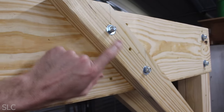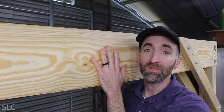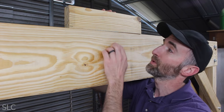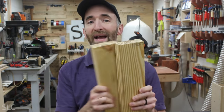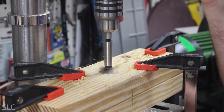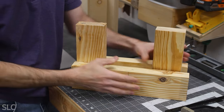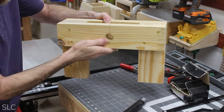When tightening down these bolts for the angled supports, I have to be careful not to warp the boards, so I included a little spacer block in between them to keep them nice and straight. I wanted these cross beams to have as much strength as possible, so I didn't want to put any holes directly through them which could weaken it. I'm taking an idea from Frank Hallworth, who put another board on top of his main supports and drilled a hole through that instead. I need two boards — one going on the front beam and one on the back — both with a hole that goes almost perfectly straight across. So I'm going to clamp these together and drill them at the same time. With the two beams separated, I'm going to secure two more boards that are a little bit longer in between those, and these pieces should slide down in between the two existing cross beams and hold everything nice and rigid.